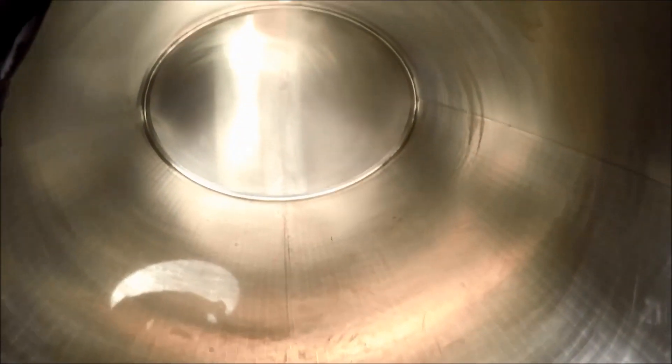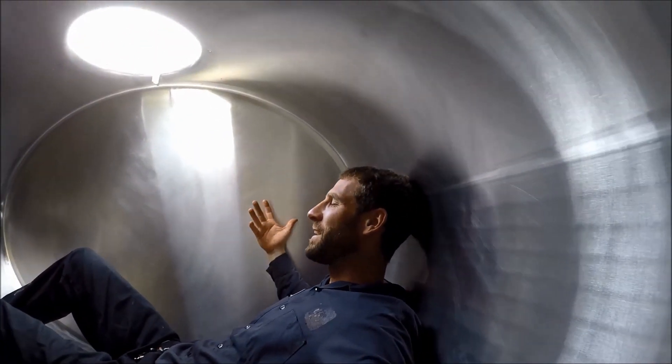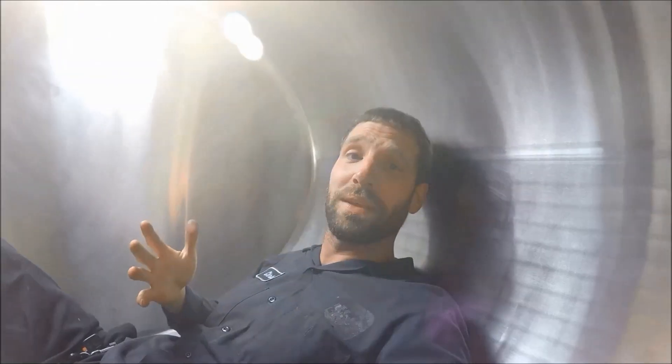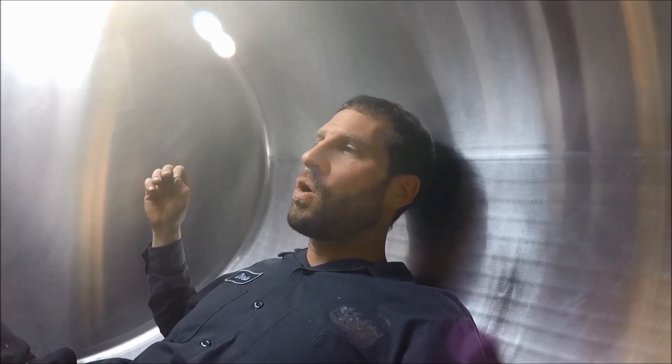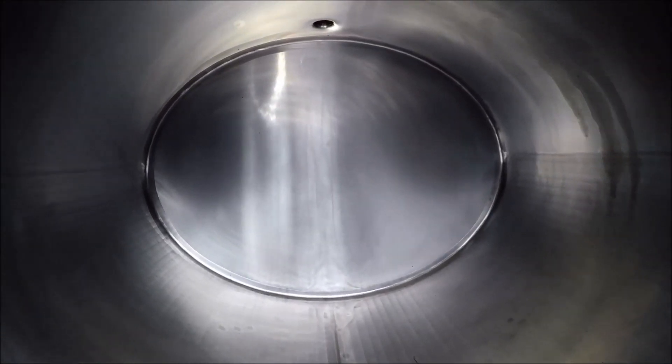Plenty of room to slide into this 18-inch manhole. Inside, I tell you, this is just an awesome little chill-spot bunker — it's comfy. You can lay down in here and it kind of kills me to sell it. I was thinking about burying this thing, but I was reading that 304 stainless will usually pit — localized pitting and perforation if you bury it in the ground, usually within about 10 years or so.